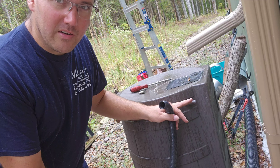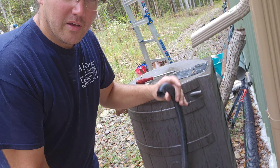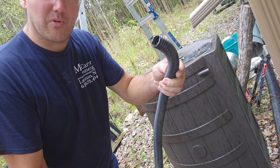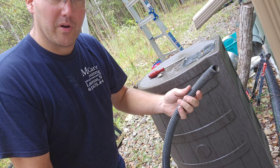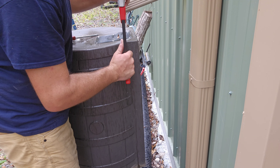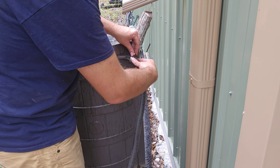The next thing we need is to take two aluminum bands, screw them to this wall, and wrap them around the spout — screw it in so it's got a firm hold against the building. I cut these myself out of the gutter coil parent stock — just straight flat pieces of the coil that'll wrap around and fasten the spout to the wall. You can buy them at Lowe's, Home Depot, wherever, pre-made in fancy shapes and regular shapes. As long as it holds it to the wall, you're fine.